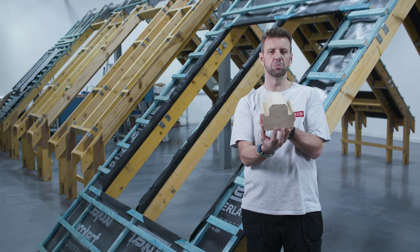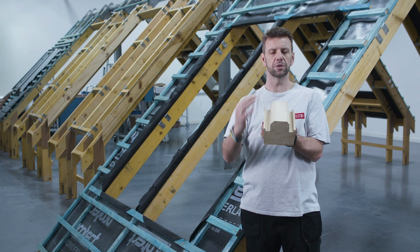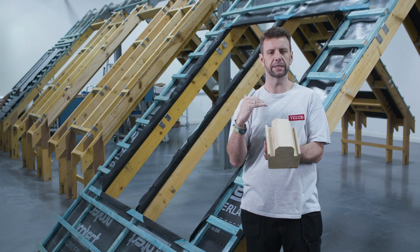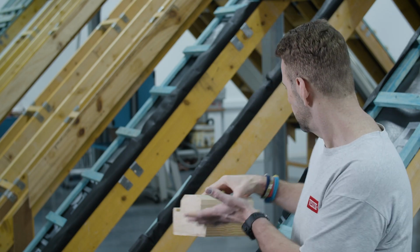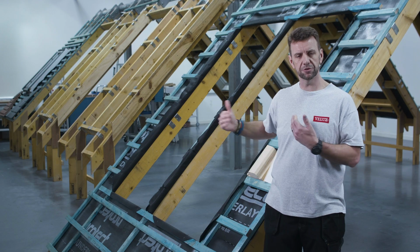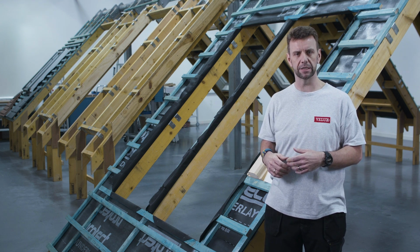Using these, it becomes more vitally important that you don't box the windows in, otherwise the brackets become visible. So always splay the internal lining to conceal the brackets behind the lining itself. Our third option is what we can see here, where we're able to utilize existing roofing timbers and just fit the windows either side and then just frame and plasterboard those into place.